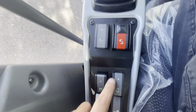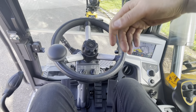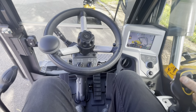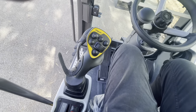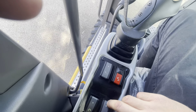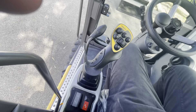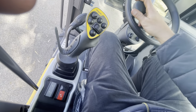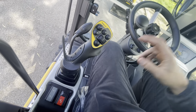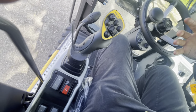So this is your bucket reverse — so it just makes it so that when you curl in that way, the bucket comes towards you. If you've got your bucket around the other way, you curl in and it's going backwards. It's handy with a skid bucket and whatnot, so you can reverse it. This is reversing the direction — so if you're working over the other side of the machine, the steering is going to feel backwards and the FNR. So if you flick that switch, it'll reverse both of those so that it feels like it's working the correct way around.